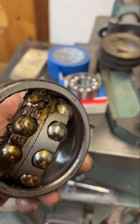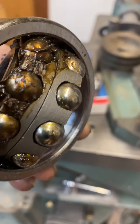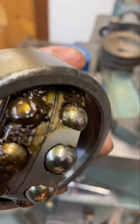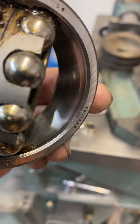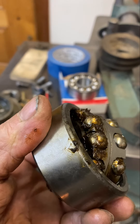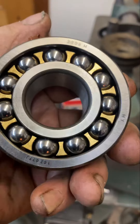How you tell if a bearing is bad: look on the outer race and you're gonna see a little ring — see that little line right there? That's the balls wearing into the raceway. You can sort of see one on the back side too. On a new one, that line won't be there — that indicates contamination or dirt. If these are the original bearings, they're from 1963, about 61 or 62 years old. That's the difference between open bearings and closed bearings.